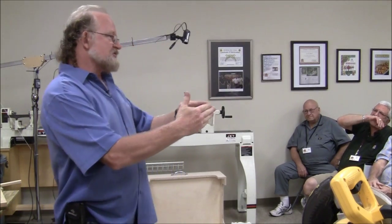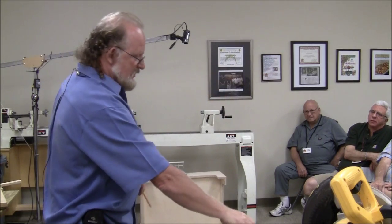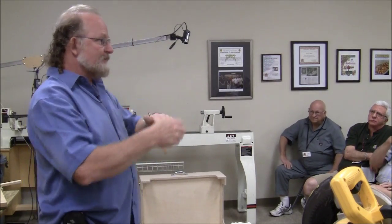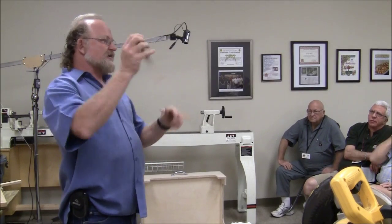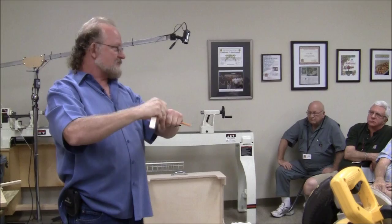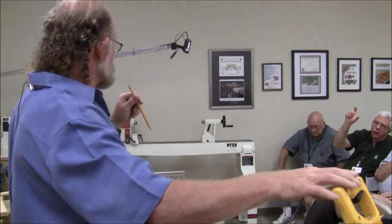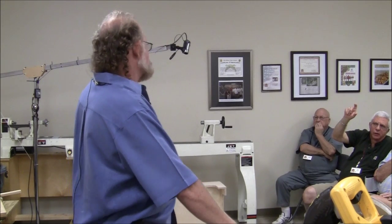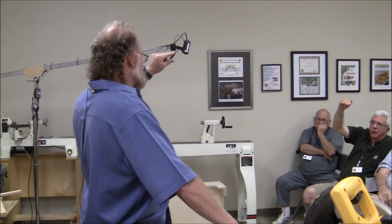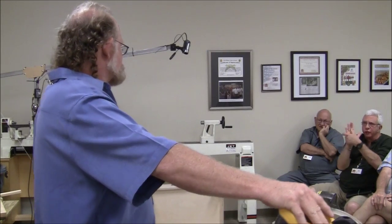So I had to watch myself from cutting them too tight. If you cut miters and put your miters up there in the corners and they don't look good, you take a block of wood underneath the two crown and keep tapping it up. As you tap it up, the corner will come together. Sometimes you may have to tap it down, and sometimes I'll take a shim and open it — if the very top of the joint's not closing, I'll take a shim on top of that crown molding and force those tops down a little bit, and then that gets covered with caulk. How far down do you have one plate? Three inches — actually about two and a half, because you've got two two-by-fours plus the thickness of the rock for the ceiling.